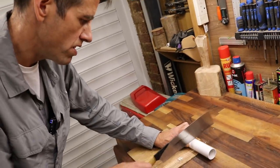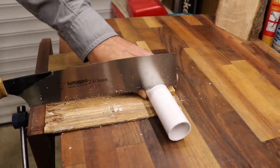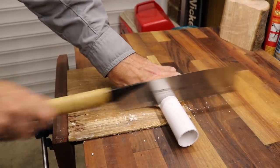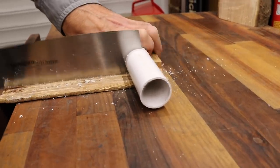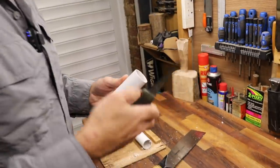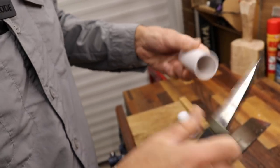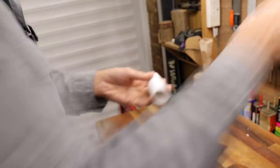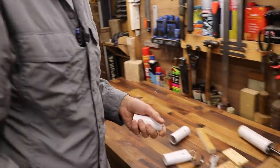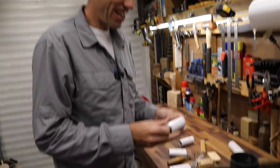I'm going to use a standard wood saw over at the bench hook. This plastic isn't particularly aggressive on saws, but cutting pipes can be a bit awkward once you've bitten through the first bit — you're cutting on two opposite edges and it can shatter a little bit. It's easy enough with standard woodworking tools. You might want to take a knife and deburr it a little bit by carving around the edges. Then we pop the kettle on — two sugars please — and wait for it to boil before squashing this bit of pipe.